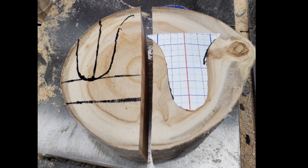It helped immensely to use a paper grid. First, I cut the maximum possible size rectangle for the flower. Then I folded the paper in half and cut a profile. After flattening that out again, I can visualize where to place the flower. From previous failures, I ensure the axis is at least far enough from the cut edge to get a full round for the flower. If you do not believe me, try this layout without a paper template — you will risk brain trauma. Finally, I trace the template and a second cut line that allows for a tenon to be used later, ensuring as much slope from the natural edge as possible crossing the flower.